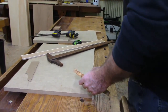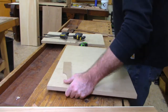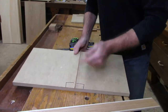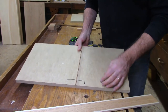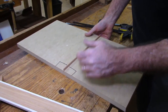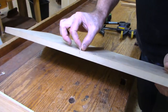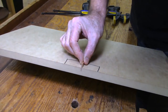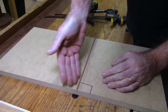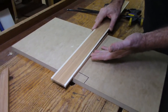Let me show you the method for attaching this. I'm going to bring in the same kind of master square board we used when making our wooden squares. I had a nice jointed straight edge of MDF and used that against the fence of my dead-on crosscut sled. I made a cut about a quarter inch deep — just a saw cut — then fit and glued in a spline of cherry that fit with no motion. This sets me up to have a nice, dead-accurate square beam to this edge, perfect for gluing on and adjusting the blade.